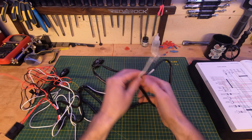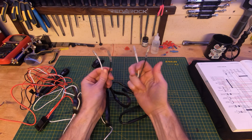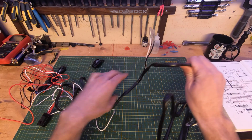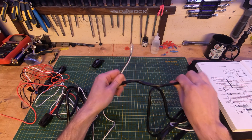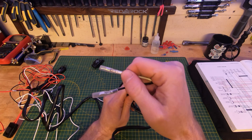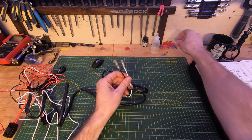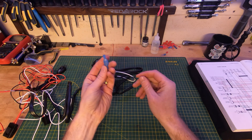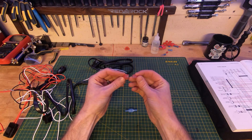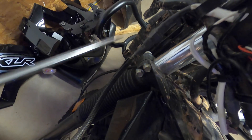The other side of this is where the LEDs connect. You have a white and a black — white is the hot and black is the return, the ground. You can see how these are tapped off of one line, so you can tell they are in parallel. The connections used here are little barrel connectors, but what I would do is chop those off and use these little blade connectors instead. I crimp those on and then put some heat shrink tubing over top to make it a little bit more water resistant.